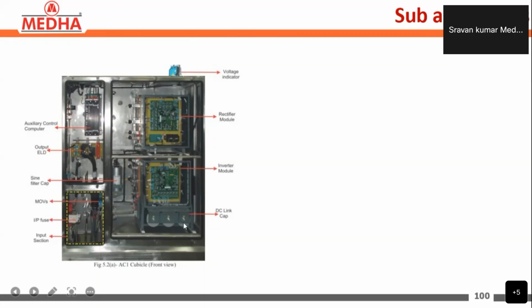From the DC link capacitors, the inverter takes the input and gives the three phase output. For filtering that three phase output, we have the sine filter inductors and sine filter capacitors. The sine filter inductors are at the back side of this module, and the sine filter capacitor is here. After that, the output is taken from here. We have the output C2 at the back side and the output ELD, the earth leakage detection, here. From here we take the output for the auxiliary load. So this is auxiliary converter cubicle 1.